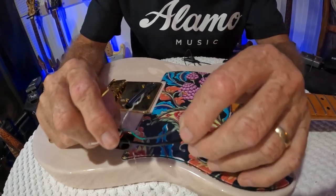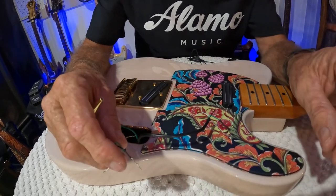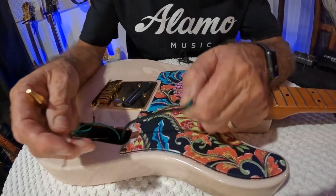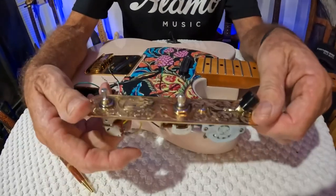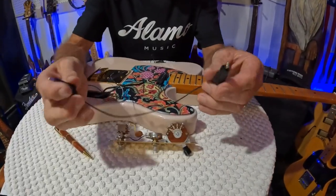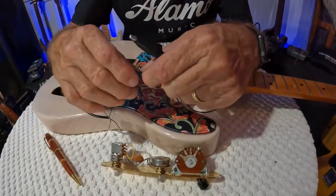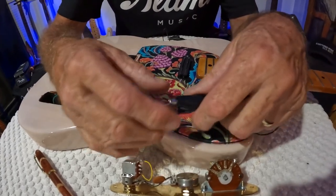On your tone knob, the wires we're going to be working with are the black wire on both pickups - the black wire on the bridge and black wire on the neck. Here's your neck, here's your bridge, here's your switch. I went ahead and dropped it in there. I've got three of these black wires made up with alligator clips - this is just so you know it's going to work correctly when you go to solder. There's your black wire - clip that on there.